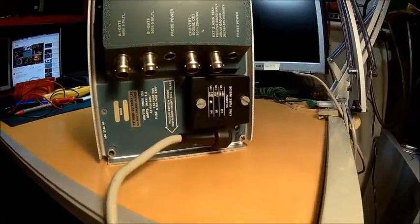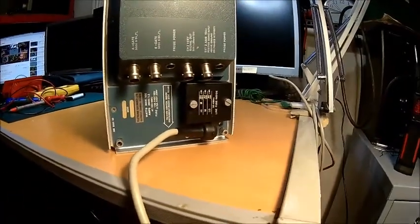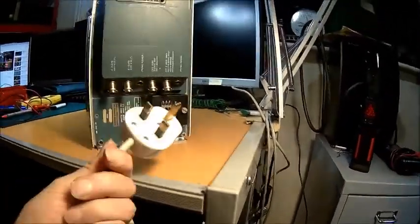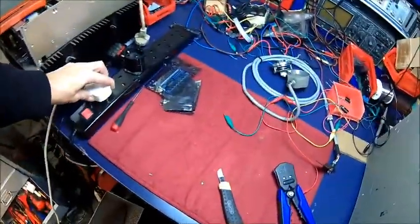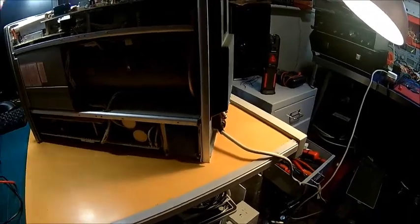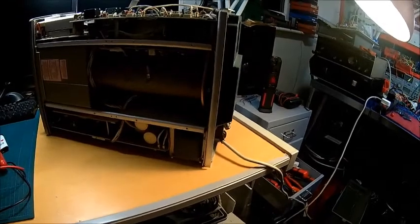We checked the mains fuse — it's a Tektronix Guernsey unit, so this is sort of UK production. The voltage selector is correct. Better fit a plug because he decided to cut it off — probably to avoid someone with no knowledge turning it on. I did a quick check: insulation resistance looks good, no major shorts.